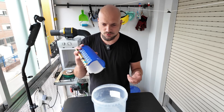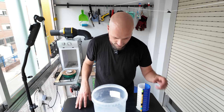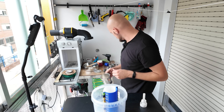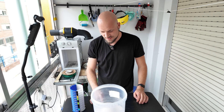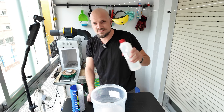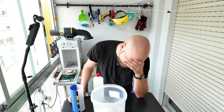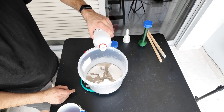So I'm going to use this 82-millimeter mold — I've shared the files on my Patreon page. Let's measure the sand I'll need: 964 grams. We add about 7% sodium silicate that I've kept in the fridge — 7% of 964 is around 65 grams.